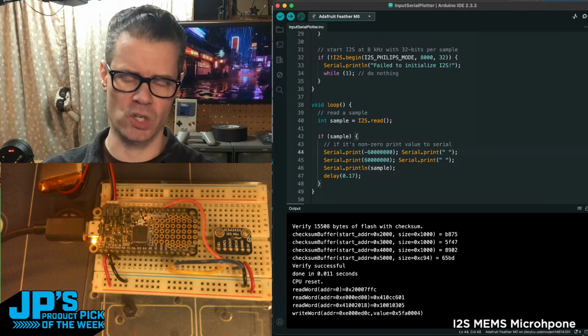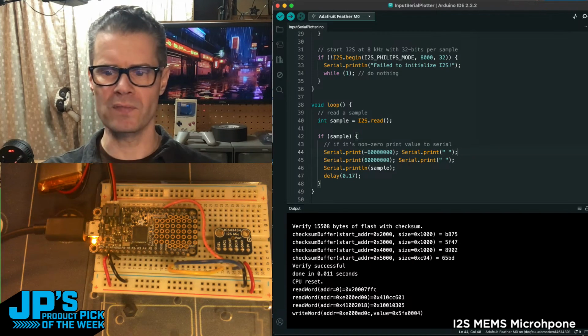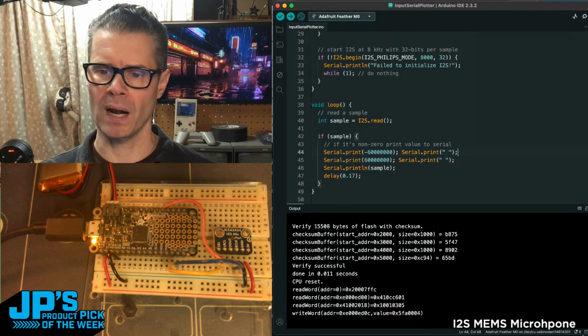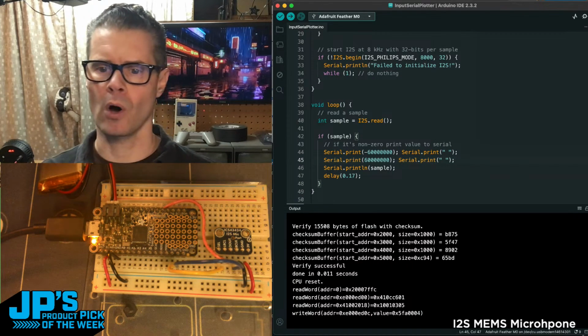Lots of changes were made, but some changes were made to the serial plotter that require you to hack around with a JS file to get more than 50 samples. If anyone's curious about that, I can paste a link. But I also found a technique someone mentioned for constraining the y-axis so it won't auto-range.